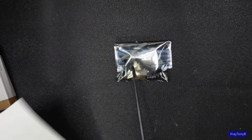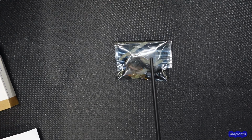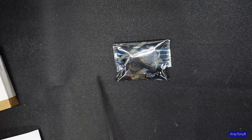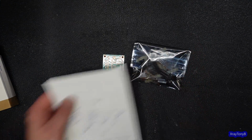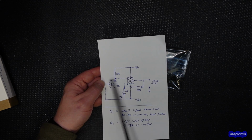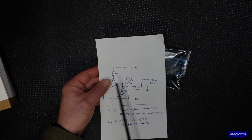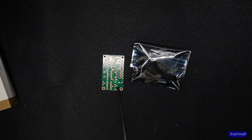And these are a lot more consistent. It gives you consistent inconsistency, predictable unpredictability. Yeah, I know, it's weird. But it's random, and it's called pseudo-random. This is totally random noise. You never know what the noise signature will be from one split second in time to another. Whereas this one will give a repeatable pattern of noise, but it's so mixed up that you won't notice it. So it'll sound like it's random noise, but it's actually not.